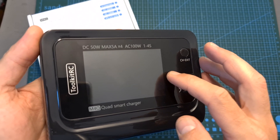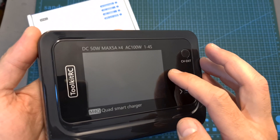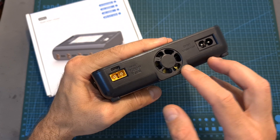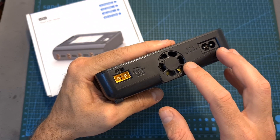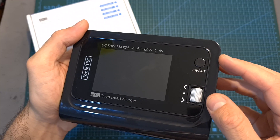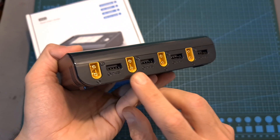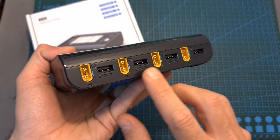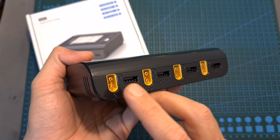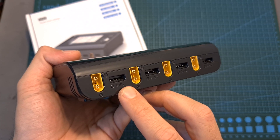On the top side of the charger, you can find a 3.5-inch color LCD IPS screen with a resolution of 480x320 pixels. On its right, bottom, left, and back sides, you can find ventilation holes, and this charger features a built-in fan that kicks in according to the internal temperature of the charger. Navigating between the different options is done using the channel/exit button and a scroll wheel clickable button. And finally, on the front side of the charger, you can find 4 channels for charging 4 batteries simultaneously, with either XT60 or XT30 battery connectors according to your version, and next to each one, a 4S balance connector.